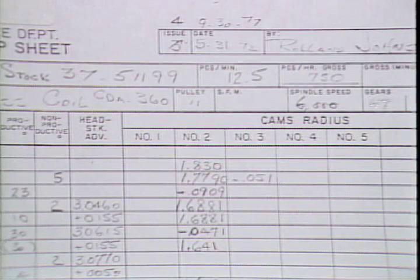You must double the total part length and cutoff tool width, then add 125 thousandths extra margin and adjust the slide travel accordingly. This will slow the action of the straightener operation. If the straightener were run at the faster rate, excessive heat on the stock and excessive wear could occur on the straightener parts.